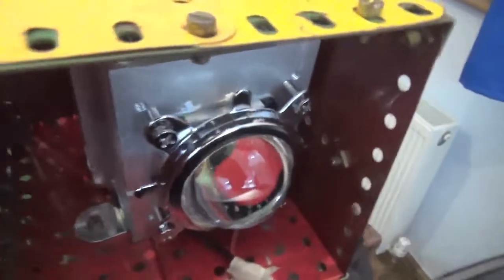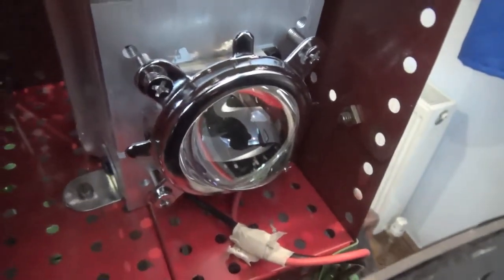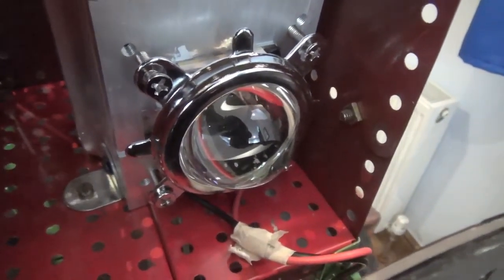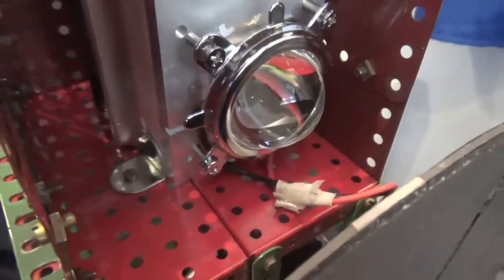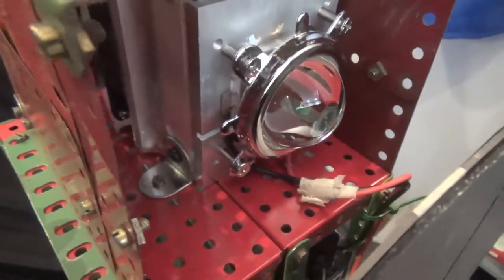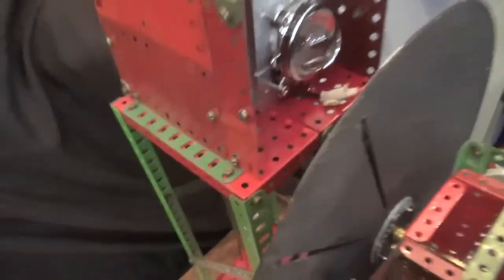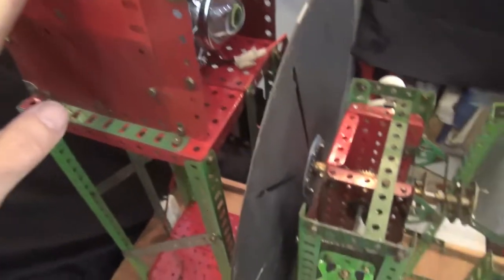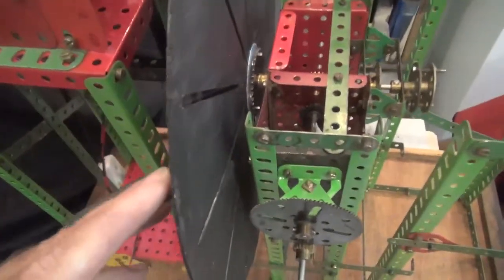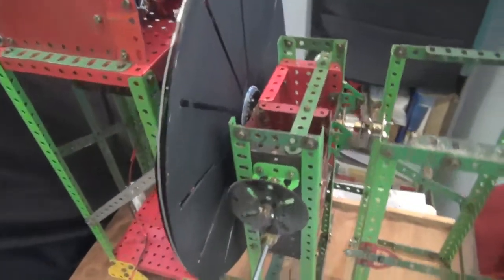Also, with this particular light unit — it's 100 watt — we're getting mains ripple, and that's evident. But I've got a 50 watt unit which generally doesn't suffer from mains ripple in production, so we should be able to clear up that problem easily enough. And there's other stuff, but let's get on and do some more fettling.